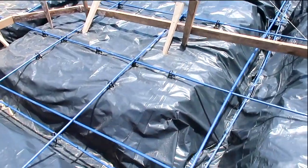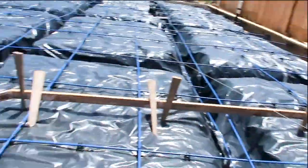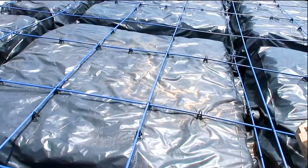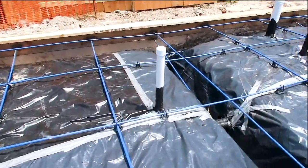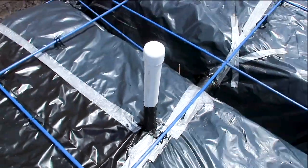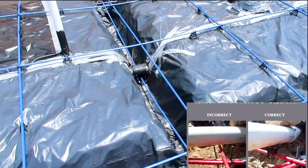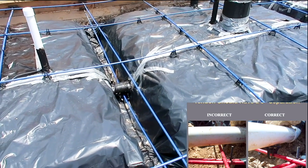Also the beams are way larger than 12 inches — they've got about 18-inch beams, which is really nice. Every crossover needs a tie on the post tension cables and then chairs. You don't want these post tension cables touching the slab anywhere. You need two inches of clearance between these beams, or a chair. You can see that's a chair link, so that's plenty of clearance. When they run plumbing and run the post tension cable underneath it, it's allowed as long as there's a chair right there. The plumbing is actually sleeved too — they have the plumbing sleeved and a chair underneath it, so there's not a chance that post tension cable can crush the primary drain line.